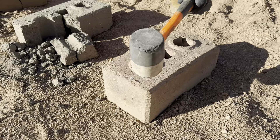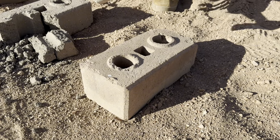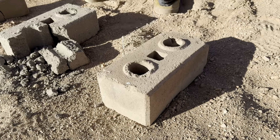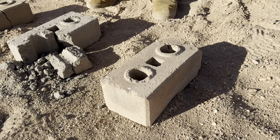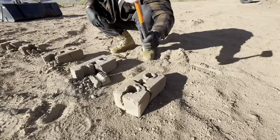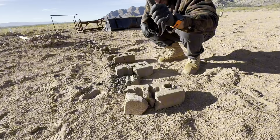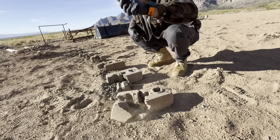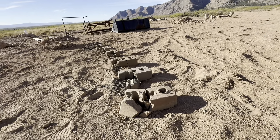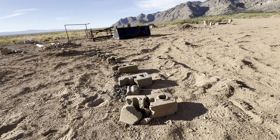Now we're back to the one we originally made a while ago. It feels hard — it was really wet when we made it, and it was hard to get picked up. Carrie and I were super gentle moving it over. This is quite a bit harder — we're barely cracking it. I'm going to start hitting it harder. This is a hell of a lot stronger than the other ones. Yeah, that's definitely strong enough — by far the strongest one. And this is the one that was 'too wet' — 10% cement mixed with about half the water or less than we used before, using a concrete mixer.